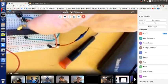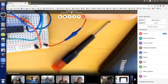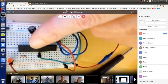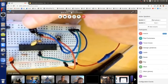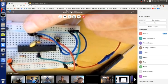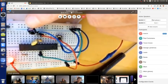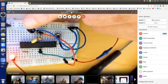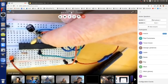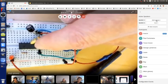that's the minimalist Arduino. I also have these two capacitors here, which are nice to have, but not required. Let me see if I can get that. So this is a big capacitor. It has a long and a short lead. The long is going to pin 7. The short to pin 8, which is power and ground. And here's a little capacitor going in parallel to the same pins, just across power and ground.